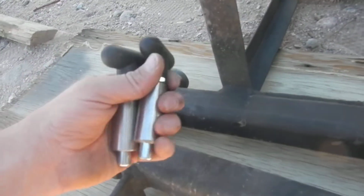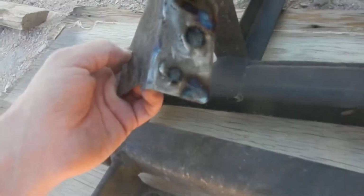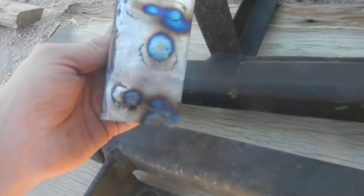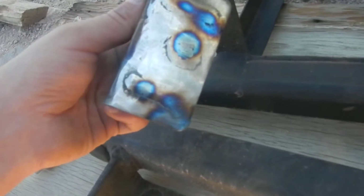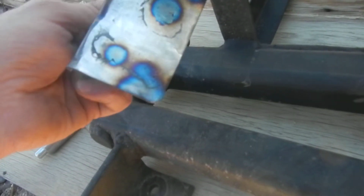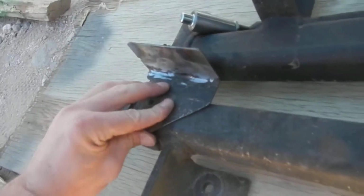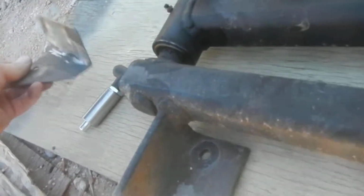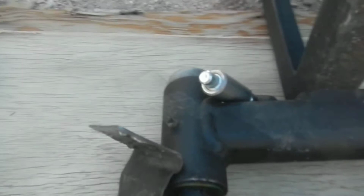So that's one project. I had to weld those there. Then these are bed frame rail ends. I plugged up the holes and welded them closed a little bit. I might do a little more on spots where I didn't fill in very well. I'm grinding it down, and then I'll weld it on the end here. In fact, where's the other one? This one's going to be the one here, because it's going to hang off the edge a little.